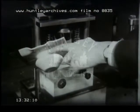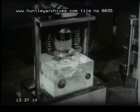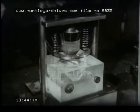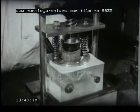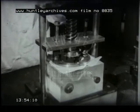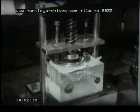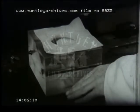Re-entrant shapes like this can be made from acrylic sheet by a modified pressing technique. A rubber nose tool is used and the mould below has been fashioned from acrylic block. The pressure is applied to the softened sheet by means of a fly press. The clamping ring is spring-loaded to allow a little slipping of the sheet to occur first. As more pressure is applied, the edges are firmly clamped and the rubber nose tool deforms until the cavity is filled. After the tool has been removed, the shaping is freed by splitting the mould.